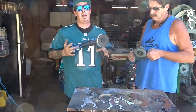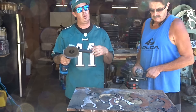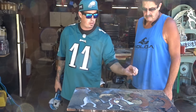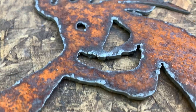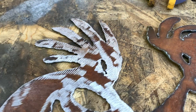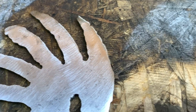We did get a chance to try out this cordless grinder from Hercules. I haven't put it through all the paces yet — that's why I'm leaving it with my dad so he can get full use and report the realistic run time, because the real world looks a lot different than on paper. We have the two Kokopelli cutouts with a little bit of slag. We decided to use the grinding wheel to show you the difference between it and an abrasive sanding wheel — he used 40 grit to sand one down, and the included grinding disc came from Harbor Freight with the Hercules. You can see the difference: one is rougher and more abrasive, the other is pretty polished and smooth — almost finished quality.